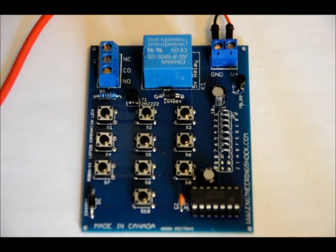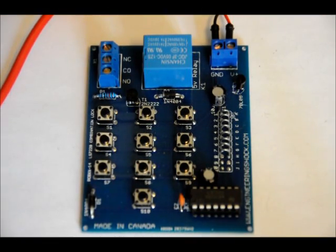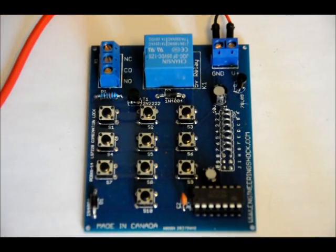I made a correction based on my last comment about how long it takes. You can swap this resistor for a higher or lower value if you want your relay to turn on for a shorter or longer amount of time. Right now there's a 10 microfarad timing capacitor, so you can gauge how long 10 microfarads will have the relay turned on. So let's type in a code and listen for the relay. The relay turned on — now wait for it to turn off.